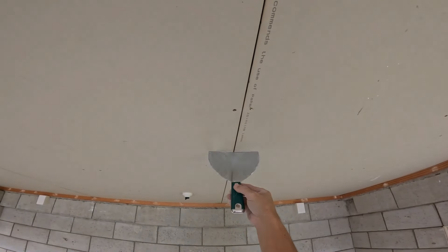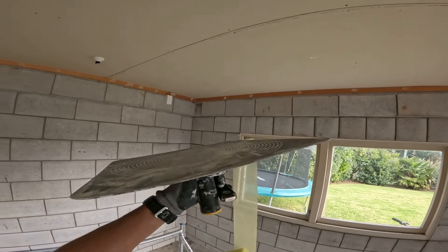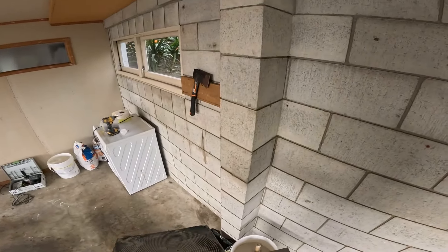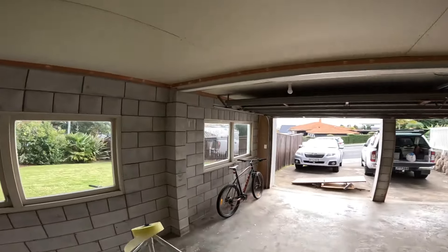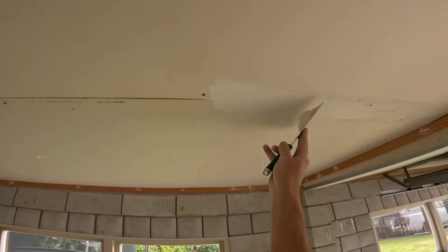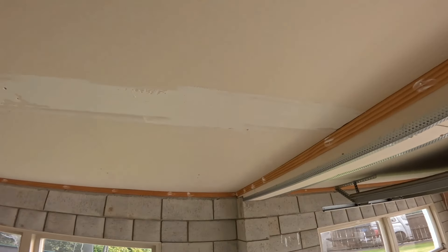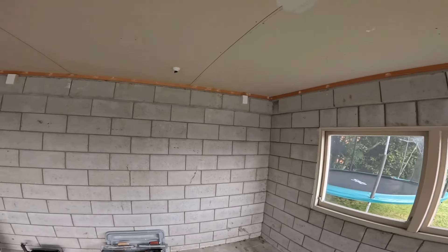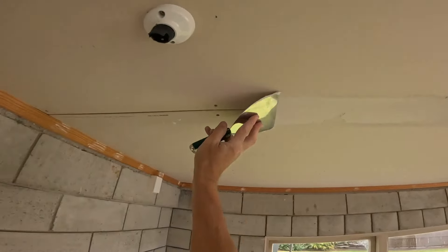Straight away there you can see we've got a little hollow just where the join is. That is the tapered edge or the recessed edge of the board when they're made. Just looking at the tape — it's a fiber fuse, the New Zealand equivalent called rock tape, just a fiberglass mesh tape. I've mixed up some 90-minute setting compound. You can use whatever you want — a multi-purpose pre-mixed compound or a setting compound, whatever you're comfortable with. When the sheets are made they put a little hollow on the edge so it gives you room to put your plaster and tape, so you don't end up with a bump — it's recessed into the board and you end up with a finished flat joint.